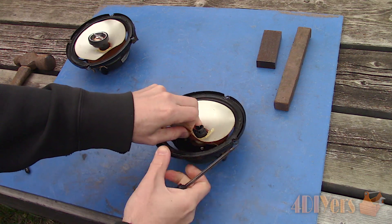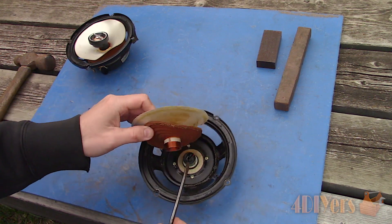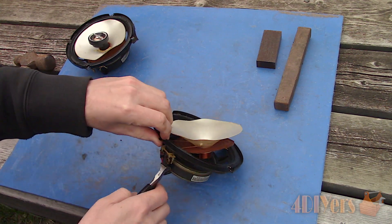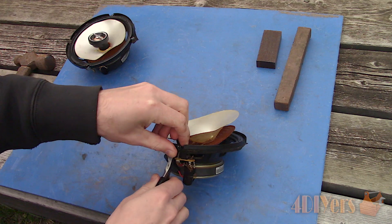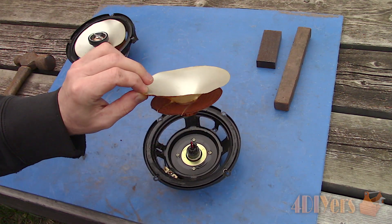The basket is just the metal exterior frame of the speaker. Depending on the strength of the glue you may have to work it all the way around. Cut the two wires on the voice coil — this can be done from the outside behind the terminals. Here is a view of the cone, spider and coil once removed.